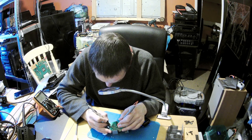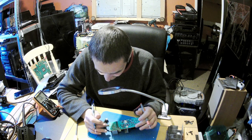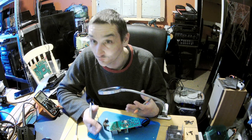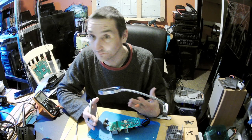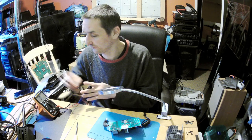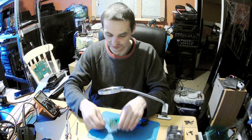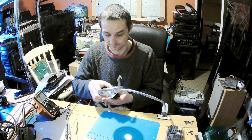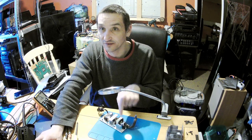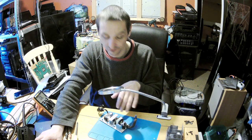Yeah, that is shorted on both sides. So if that would be two diodes, not a MOSFET, that would make sense. If that's a MOSFET, it shouldn't be shorted, unless the transformer is faulty and causing the short. That would make sense then. Okay, I'll try to pause it, read it, what's there. Is it a MOSFET or a double diode?